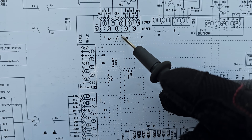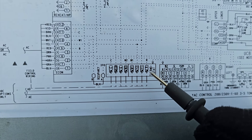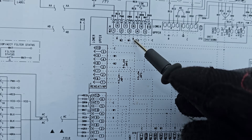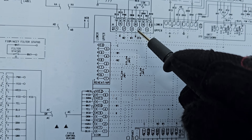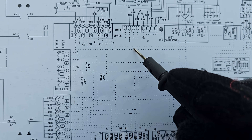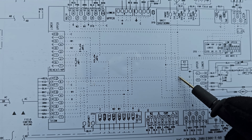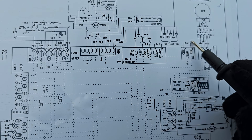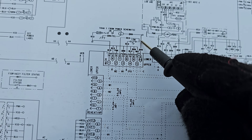So if this limit switch is open, the 24 volts - which is what R represents right here - there will be no 24 volts at R. If there's no 24 volts here, this R represents the R terminal where the thermostat connects. It's only going to get from here to there if this limit is closed, as I traced it out. It goes all the way through here, across here, up to terminal seven, and comes back to eight from the limit switch.